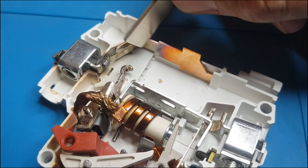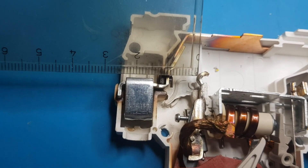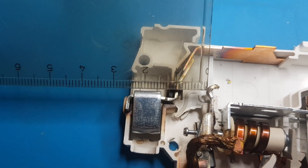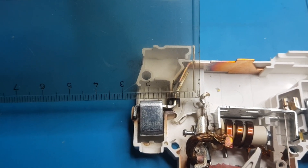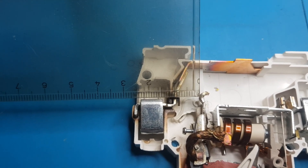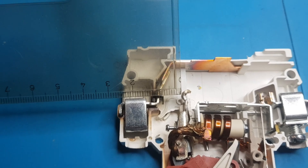As you can see on the ruler, when the contact fully opens it opens up almost nine millimeters — that's a really big gap. If the breaker is non-polarized, the arc needs to be somehow extinguished and the gap must be quite large. This looks correct — this seems to be a genuine non-polarized breaker; that is not a lie.